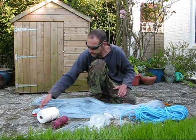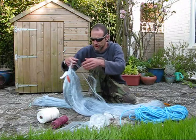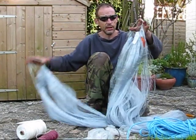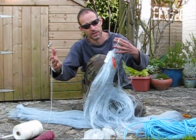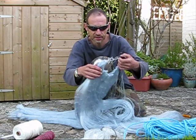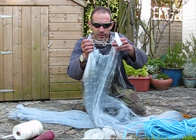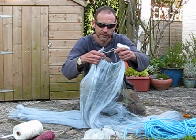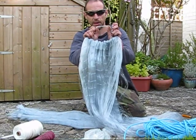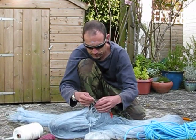So our machine made net here — I will do another video on how to make the net just starting from a piece of cord. What we need to do is when we buy our net, it's tied together. The ends of the net — every single mesh has been gathered up on some cord. It's really important that when we cut this cord, we make sure we've got it attached to another piece of line. What I've done before is cut this without keeping it together, and then you have to spend hours re-sewing this piece of line. So first of all, find the centre of the net — it's normally marked with a little tag or highlighted with some red dye on the end. And we've found the centre of the net. We're going to cut this cord out and attach a new piece of cord to it, which we're going to end up running on.